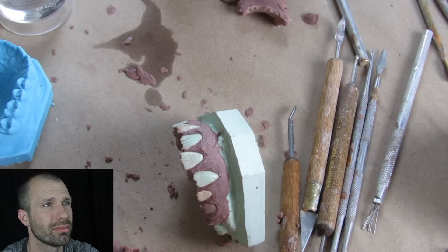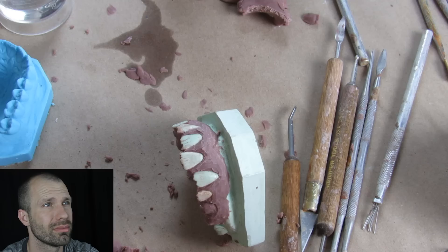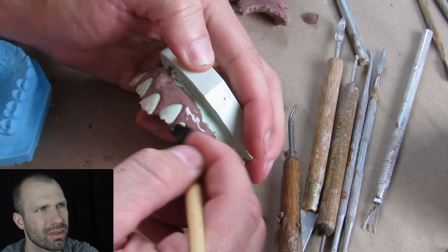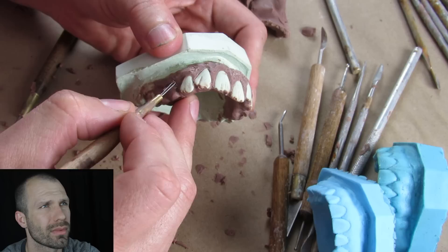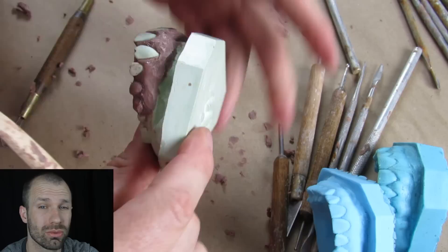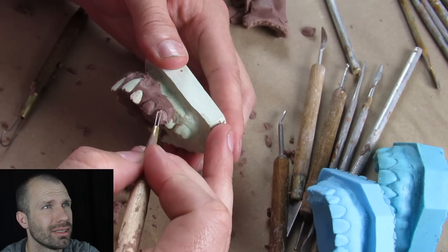This is just a really easy way of making teeth — not too hard. Just placing them wherever you want them, and now I'm sculpting out the gums. The back teeth further back I'm just going to sculpt — I don't have to add those individually. It's much quicker and still going to get a good effect. Right here I'm just using a brush and alcohol to smooth everything out — this is my first process of smoothing, just doing a brush over it. Then I'm going to get the blow torch and heat up the clay, because once you heat up the clay it gets really smooth.